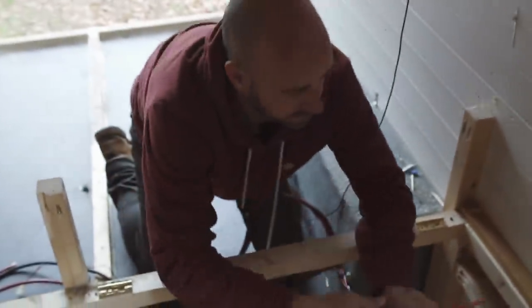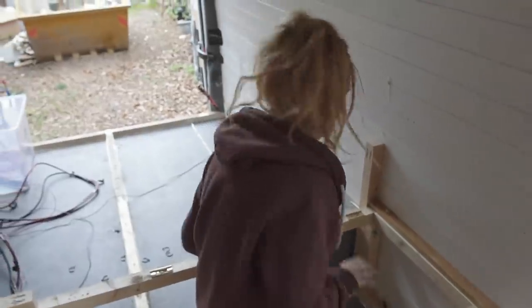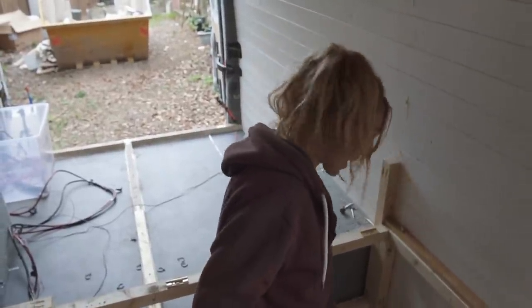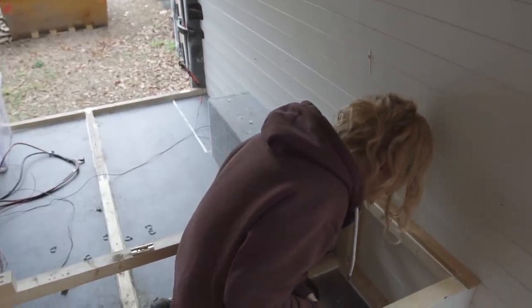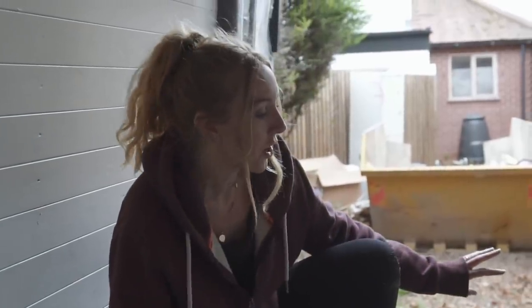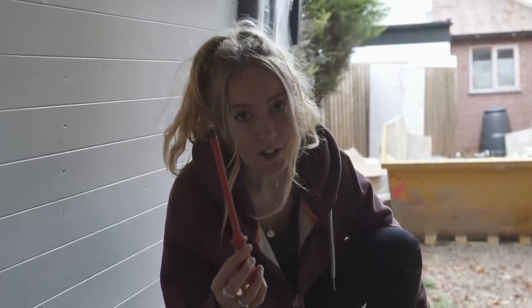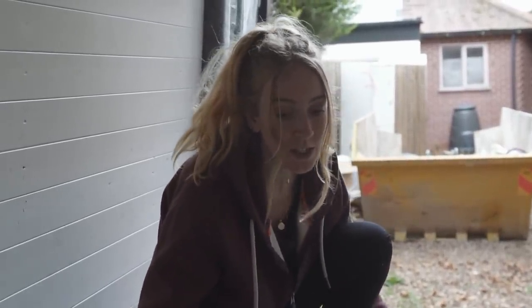Please may I have a flat head screw? There's always like — how many brackets do I think? I feel like we've taken every screw out here and it won't budge. Where is it being held? I know we've glued bits in but this is ridiculous. I've just managed to take this back baton off — a lot of the bottom ones are also secured with adhesive sealant. I'm taking this big flat head screwdriver and literally just scoring along it to break the seal and it just pops off.